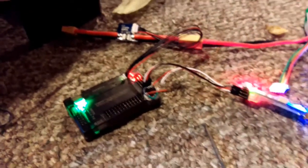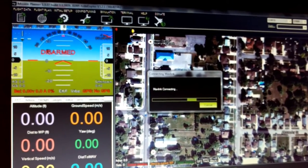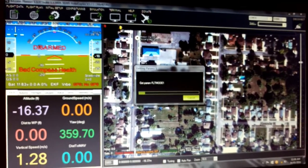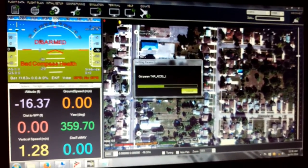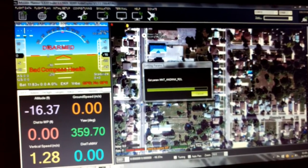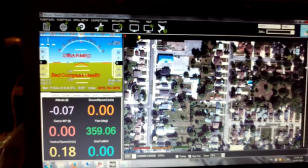Wait for it to finish its little flashing. We're blue on everything, as you can see. And if this is successful again, I hit connect and we get action. This thing's been plaguing me for days. So the secret was to change both serial ports to those settings. I was able to leave the USB speed at 115. Well, you can see here, I don't know if it's actually connecting at 57.6, but that's the setting I put. And I'm not gonna change a damn thing.